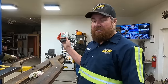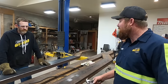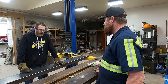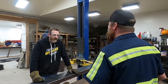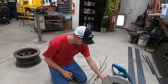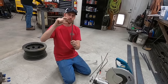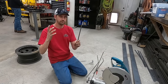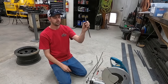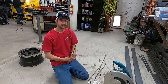We drilled the holes, chamfered the holes, did some sanding, and now we're going to start welding these together. I am cutting out the rods that we're going to stick through those frame rails and weld each side to pin the rails together so they can't expand when we fill it with air — as we found out, they do. I've got to cut out 32 and 9/16-inch rods.